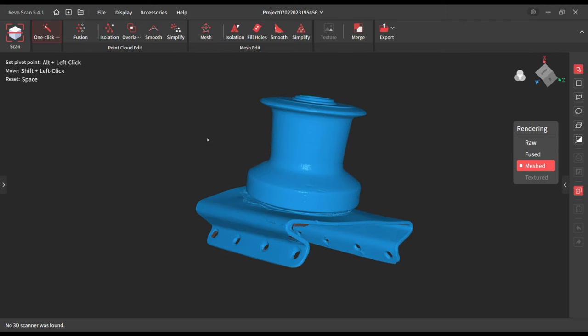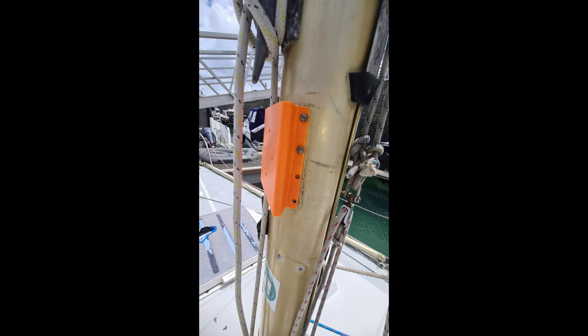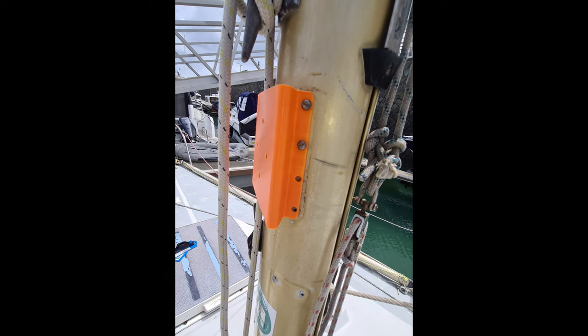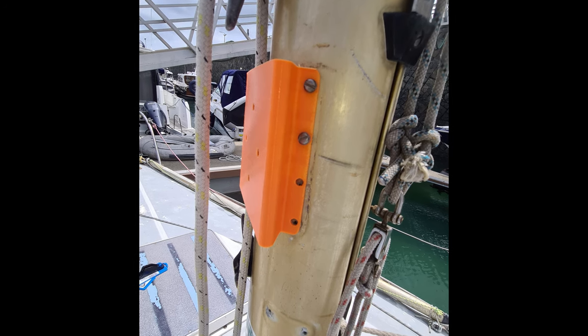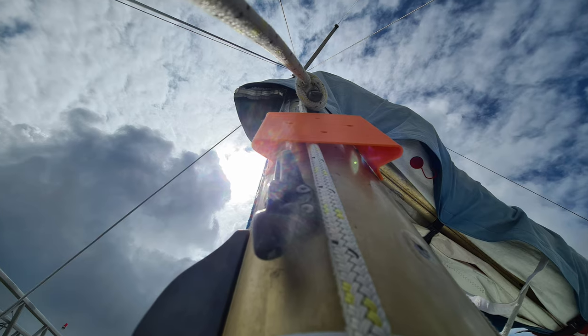I was able to design one in some CAD software and 3D print it. Here we can see it held up against the original item. I don't really know why I was copying the factory item so much — I just thought I'd give it a go, more to get the mounting holes if nothing else. But I took it to my fabricator, and bad news: he doesn't think he can make it in stainless steel in that shape. He feels the radius of the curves are too tight and he won't be able to form them.